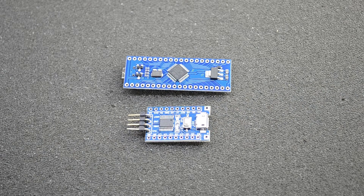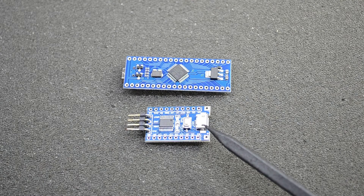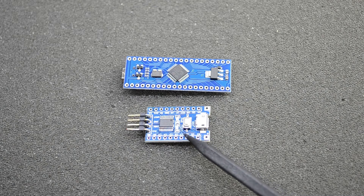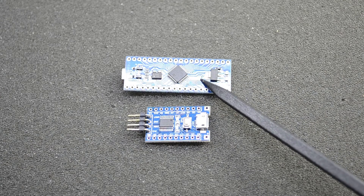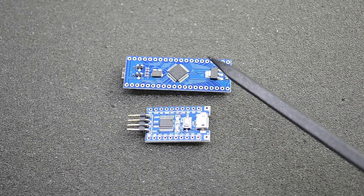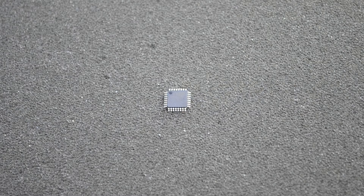As the main processing board, I first wanted to use an STM8 microcontroller from ST, just to give it a try because I never used them before. I had a small dev board for STM8 in my parts bin, but immediately realized I don't have the required programmer for this line of microcontrollers, so I had to switch to something else. I could have used an STM32 board, but it would have been seriously overkill for this project, so in the end I went with the ATmega328 and the Arduino environment.